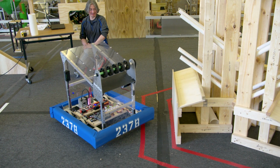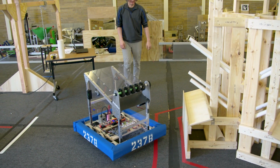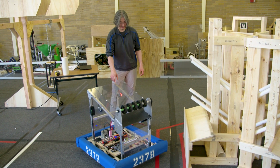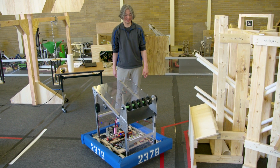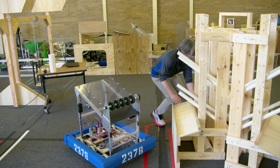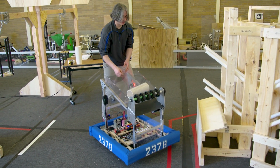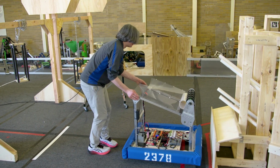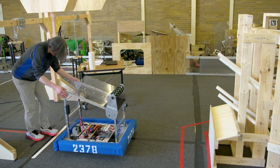OK, we learned some things. Thing number one, we finally missed. So I am going to tweak that power value down. And we turned, what would you say? That's about halfway. That was about 45 degrees. So we want to turn for about twice as long. So we can update both of those things, and then we'll run it again. Also, I do think we are approaching the point where I need to reset this. We moved it back almost 2 inches now from our repeatedly crashing into it.